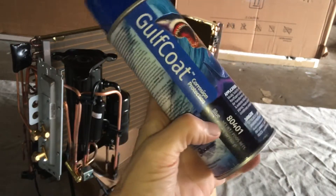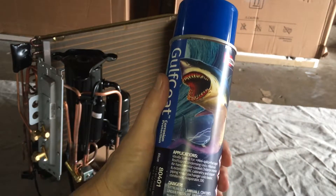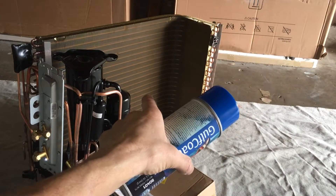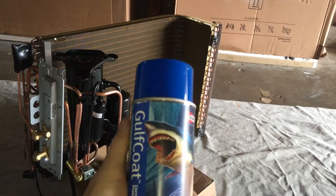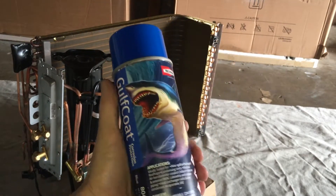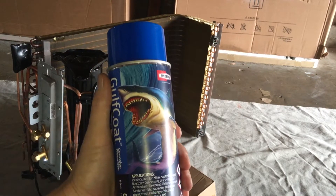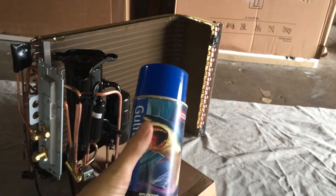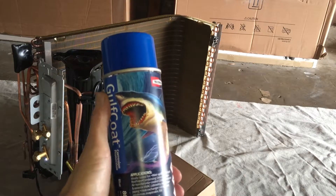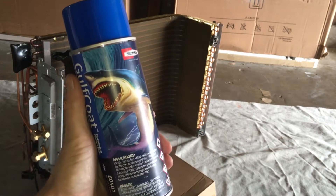I intentionally got the blue version because I want to be able to see it. I'm going to put two coats on here because this unit is going into a saltwater environment off the coast of San Francisco. Anybody who lives on the coast knows you start getting pitting and problems usually within five years, sometimes ten. In coastal areas like Louisiana, guys start seeing systems rot out within five years — new condensers needed, fins falling apart. This is one way to put that off by another decade if applied right.